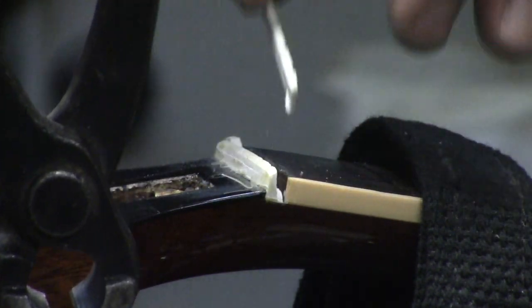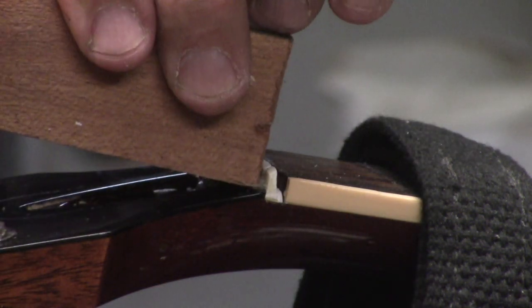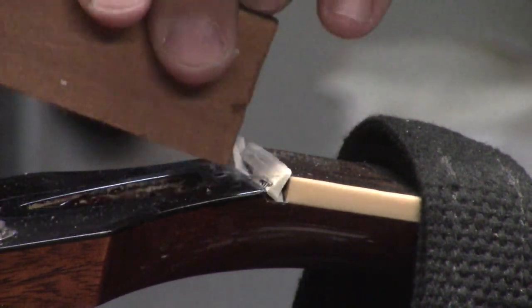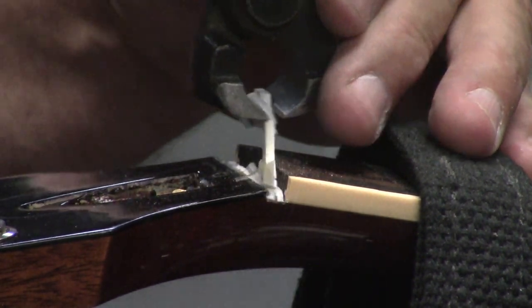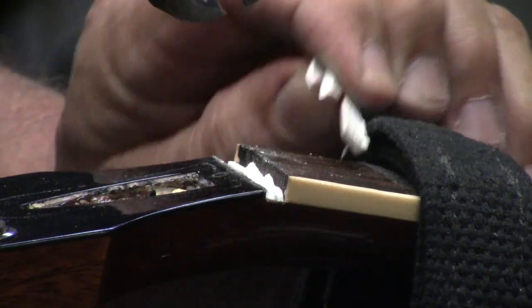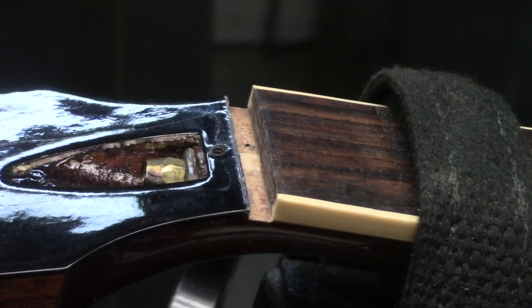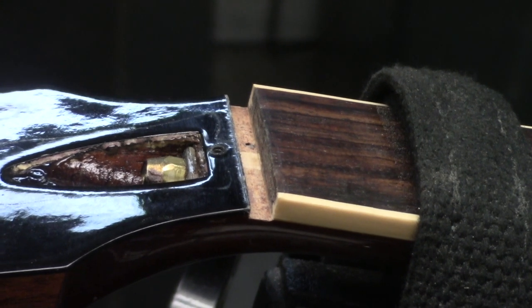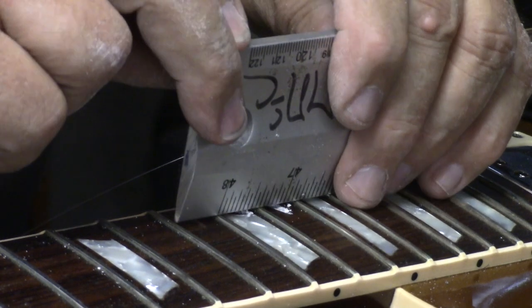Yeah, she's coming out like an impacted tooth, which is usually the case. So I'm giving that just a little bit of a tap to get it away from that leading edge. This is what you can expect. Don't make it easy. Most important thing is we get this out ultra clean right on the glue line. Even these super glued nuts, if you go easy, you can still get it out super clean, right on the glue line. No lumber. There's just this one spot right here.